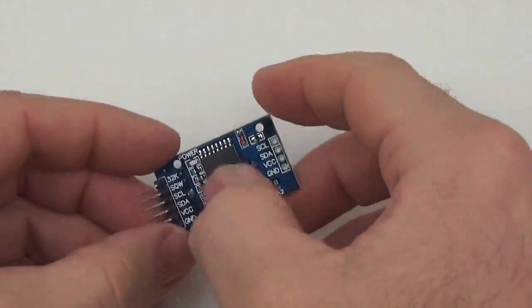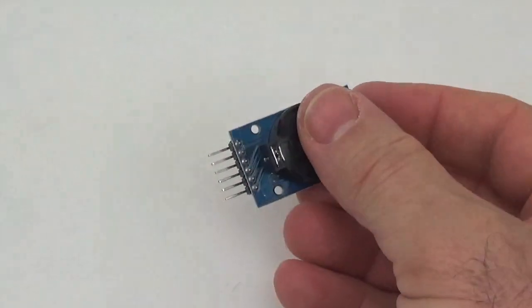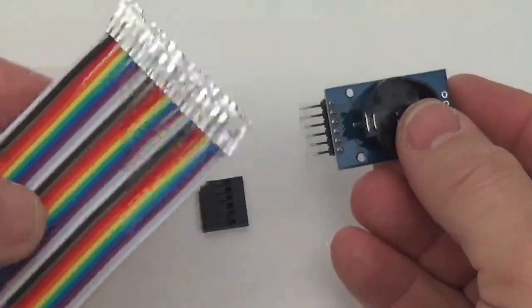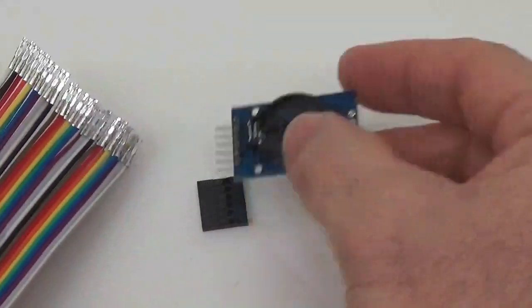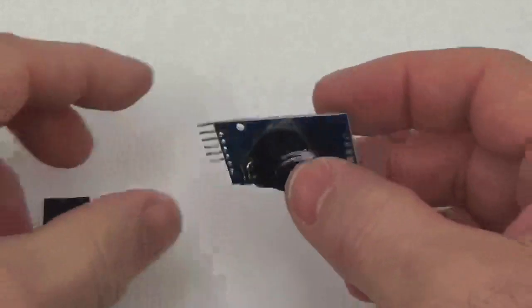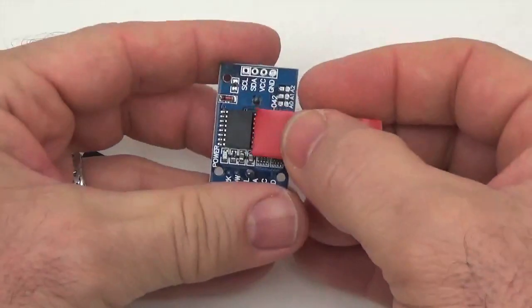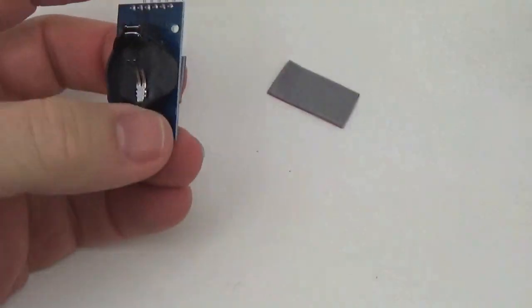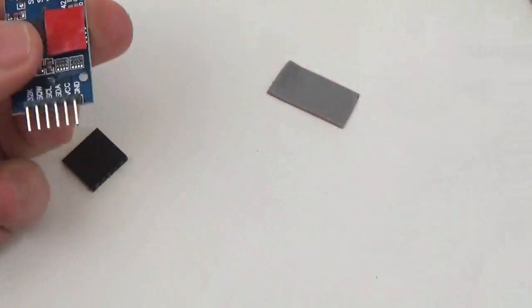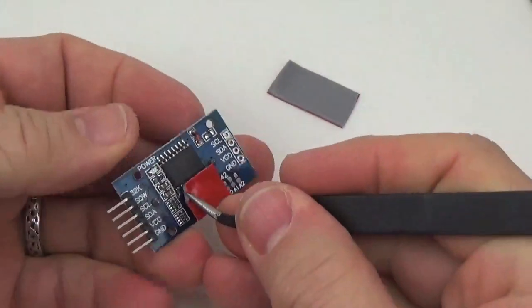We're going to first put a little bit of tape across the chips here, and then we're going to make another Dupont connector, just as we did for the SD card. We're going to take some of these raw Dupont cables and put them in a shroud, and then that allows us to connect the RTC. So the scrap tape that we had from taping the board works really well for this, because you've already got it cut and you're just one layer over the small chip, and then another layer goes across both of them. This is just for leveling this first piece.